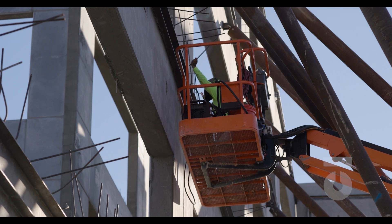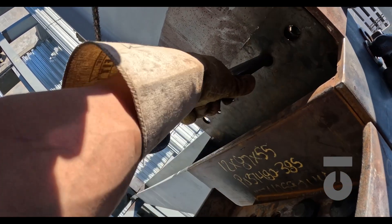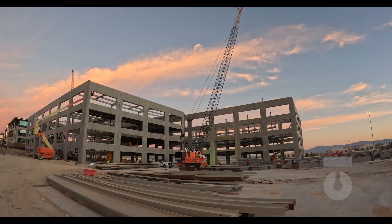For example, the Raising Gang is in charge of picking, rigging, and setting material, while the detail crew plumbs, sets bolts, stairs, railing, etc. Putting aside the different groups, this section of the course will dive into what the erection process looks like. We are going to outline what may seem like a step-by-step process, but the truth is erection is a moving machine that may have many things happening all at once. There are foundational phases that need to occur in order to set things in motion, so look at this process and then take a step back to see how multiple steps can be happening simultaneously.